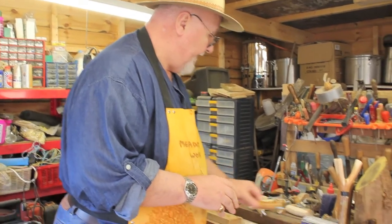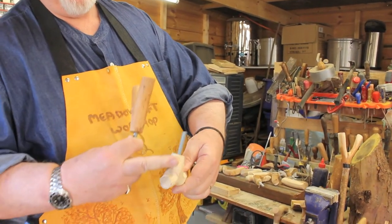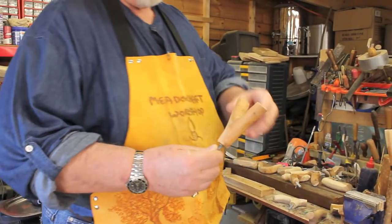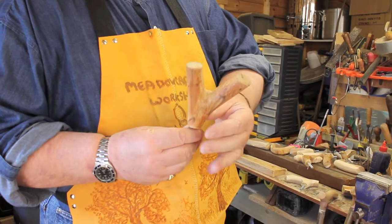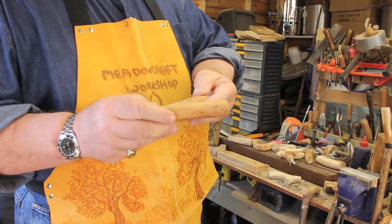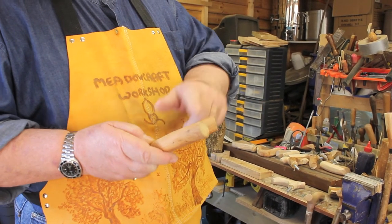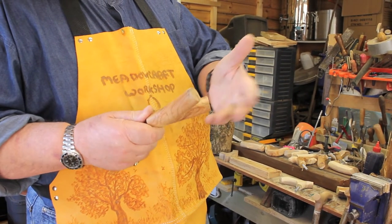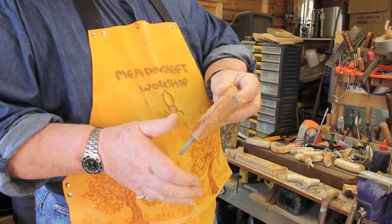When you rough them out, the next stage is some filing - you've rasped it to rough shapes and you see all the knocks and knurls and gnarls that you've got to take out. Then with finer files you start making a shape, and you've got to follow the grain of the wood - because otherwise you're going to get splits. Sometimes you don't notice it until you've got to this stage and you've missed the grain and got a nasty fault in it. Then it's no good - you've got to bin it, and it becomes jewellery rather than a stick handle because it's not going to be load-bearing.